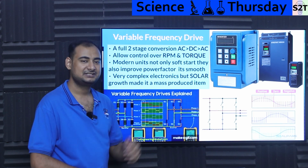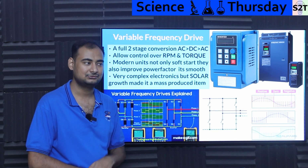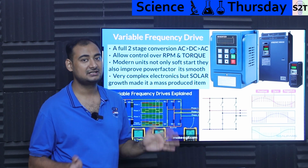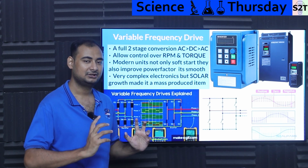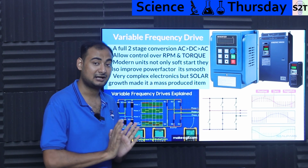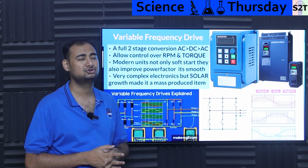Well, because the VFD is sitting there and it's like, hey, if I give it RPM, the laws of physics will stop me from actually accelerating the car. But what if I give you torque? Basically torque being voltage. So it gives as high a voltage as, again, within the safety limit it can give. So the benefit is the motor does not have a lot of rotational RPM, but it has enough oomph that it will actually break through the inertia barrier, and then your car picks up very quickly. So that initial few seconds, that's why electric vehicles are so quick.